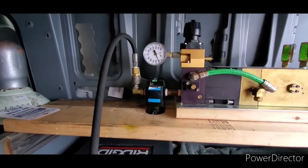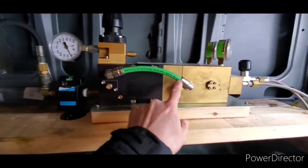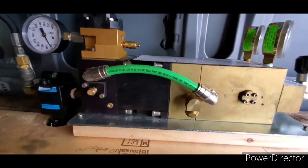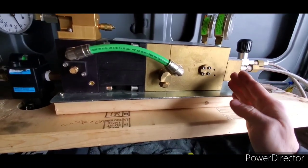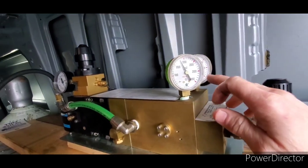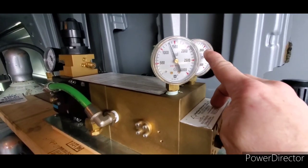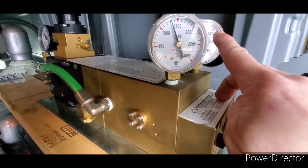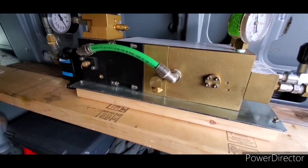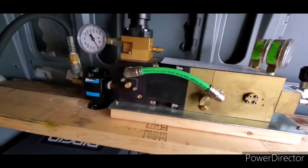This would normally be your air pressure in, using 90 to 100 PSI. This has a big valve inside — a compressor piston that goes back and forth. It takes 90 PSI on this side and, from as low as 500 PSI of oxygen, runs it all the way up using this valve to get to 1,850 or even 2,000 for medical oxygen. You can actually pull that off with only 90 PSI on the drive side because of the way hydraulics work — a low pressure on one side can produce a high pressure on the other side through volume differences.